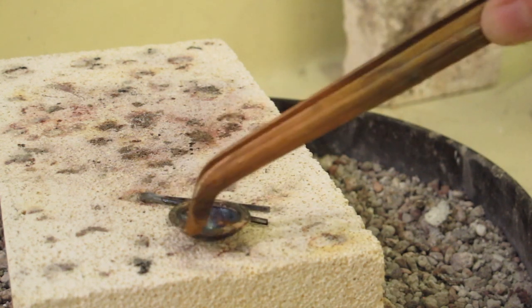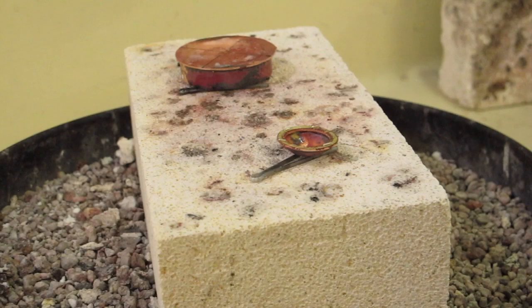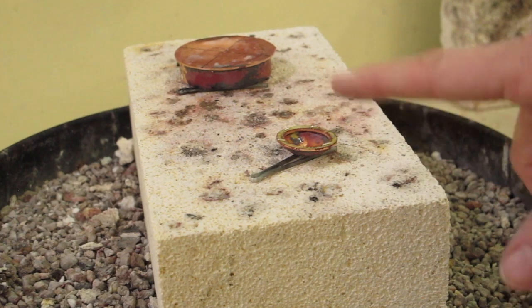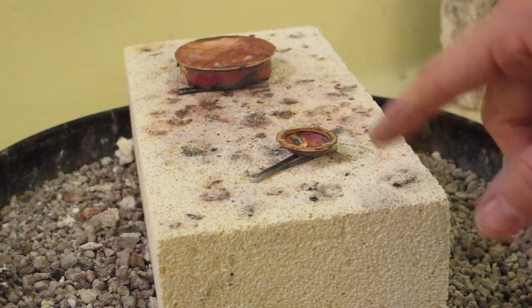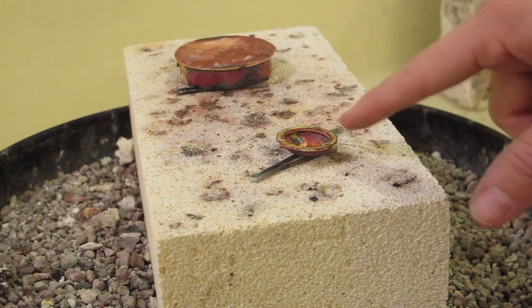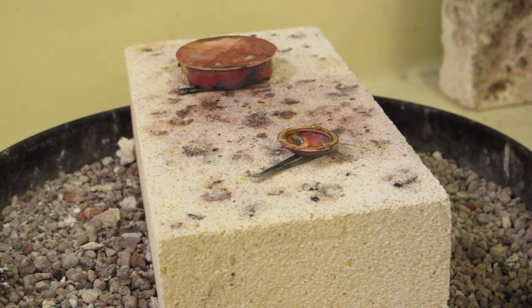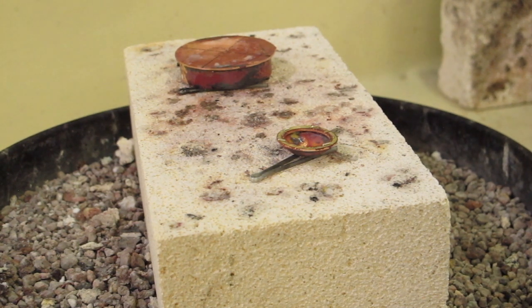So next step, I'm going to set this up like this. I'm going to put some medium solder pallions here, and then I'm going to put it onto my container after I've pickled and cleaned it. So I have the dome that we just finished, and I have sanded the brass so it's nice and clean. I put flux in there, and then there's little pallions of medium solder. So I'm going to solder this and get those balled up, and then I'm going to put it onto my lid, sweat solder it down.